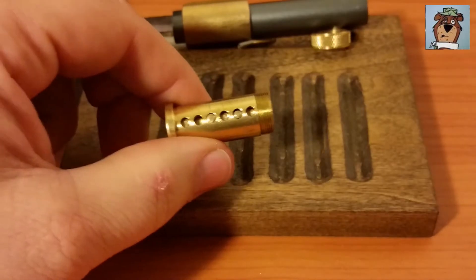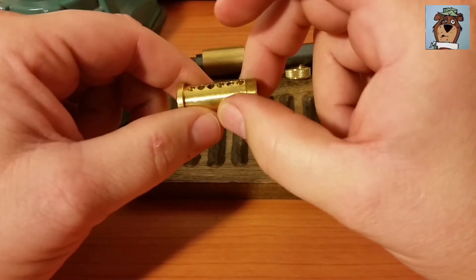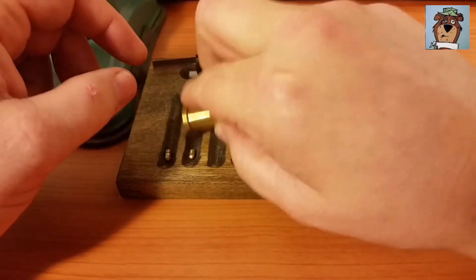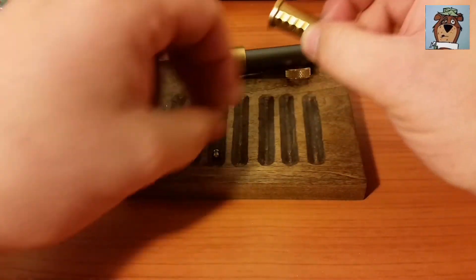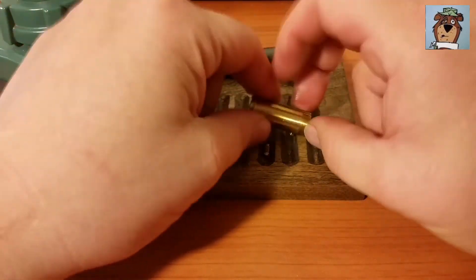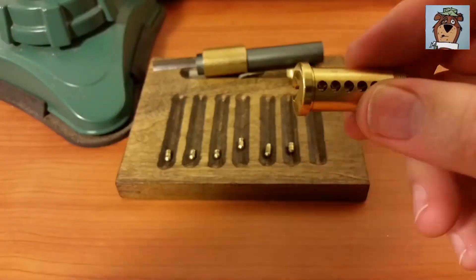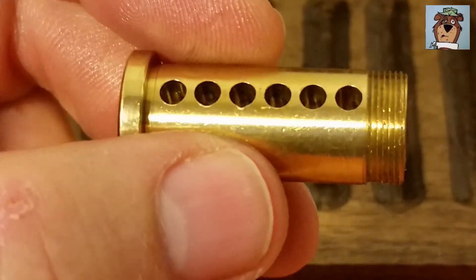All right, let's go ahead and dump these pins out. I see a reduced diameter on five. Oddly enough though, I didn't see any threads. Must be tight tolerances because these things aren't wanting to come out real easy. There's no grease in here - grease is normally what holds them up. Well, I guess there was some grease in there after all - it smells like WD-40.